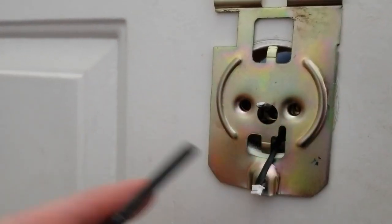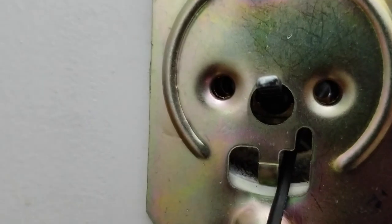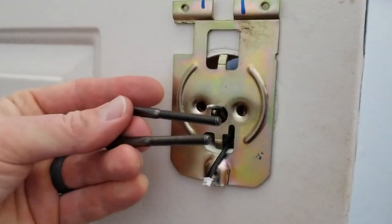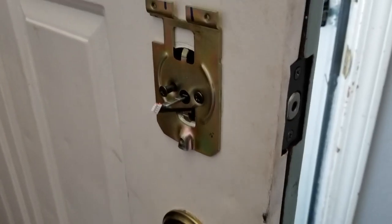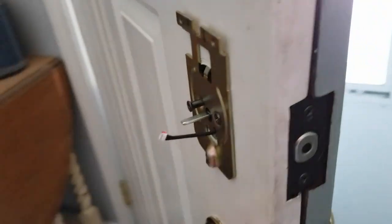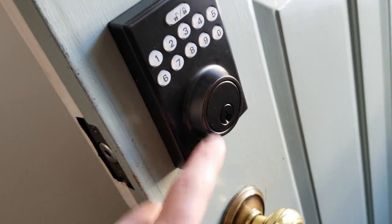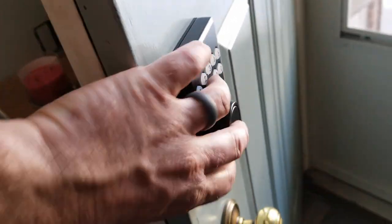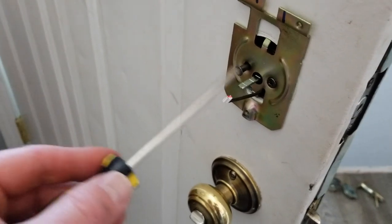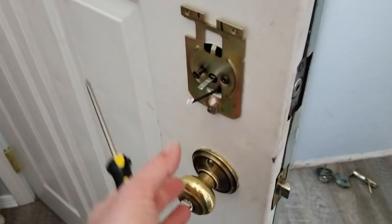The bracket's being held in place by the rod right now. What we're going to do is put these two mounting screws — one into this hole, one into this hole — and they'll connect with the other two screws from the keypad, which will tighten down and keep the bracket in place. You've got one screw in right now and we're putting the other one in. You really do need to hold everything flush and make sure this specific key lock is in the downward position. It takes two hands — hold one end while using your screwdriver to screw in the second side.